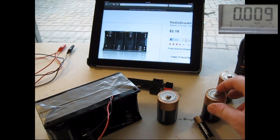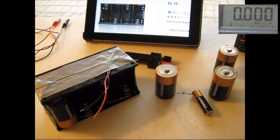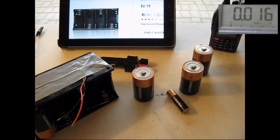So at 1.5 volts per battery, if I have eight of them, I get 12 volts, which should power most of my radio communications equipment. For a quick refresher, alkaline batteries like D cell batteries or AAs are 1.5 volt batteries.